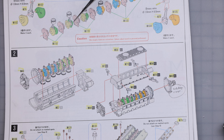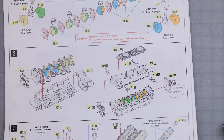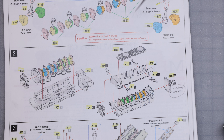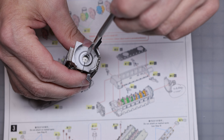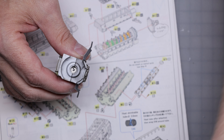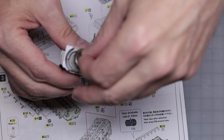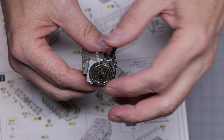I put it in. When it's all in there, this piece — which is a flywheel — it shows it installed here, which I did not do. Thank God, because it would have totally not fit. When the crank's in, you go and put this on the end and it doesn't even meet it. I had to actually cut off the mounting boss just to make sure it wasn't interfering when I go to install it. It'll just drop in here and it'll rotate — I'll probably just leave it rotating. And then my clutch goes on top there, and it looks the part.